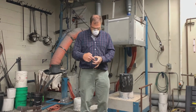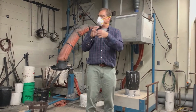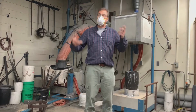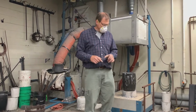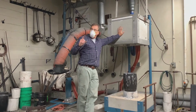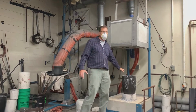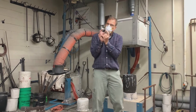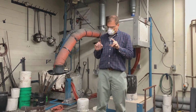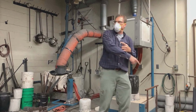Okay, so you have a coil and a coil inside, and the number of turns on that coil will determine if you're going higher voltage and lower current, or the reverse. Here though, we only have one coil. So you're inducing a current in the metal that's in there. When you see this metal melting, what you see is arcing between chunks of the aluminum or whatever's in there. What's happening is it creates an eddy current,